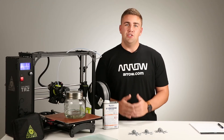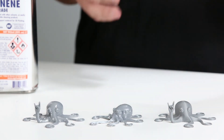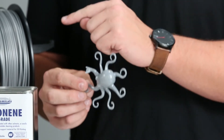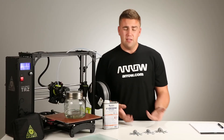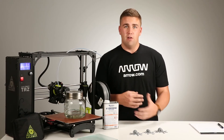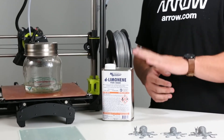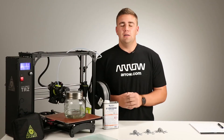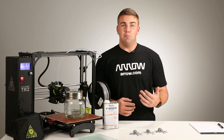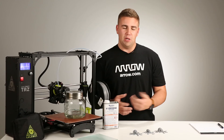Another thing to consider is adjusting your shell thickness, because when you increase your shell thickness you prevent the collapse and dissolving of that external shell. On this one, for example, I ended up doing four times the diameter of the nozzle — the default for LulzBot is three times the thickness — so there's just a little bit more wiggle room for dissolving in the vapor bath. We also used a lot of ventilation, not because limonene is bad for you, but just to err on the side of caution. A nice thing about using HIPS is it is a lot less carcinogenic than ABS — so instead of carcinogenic ABS and acetone, you can use less carcinogenic HIPS and limonene, which is a big bonus.